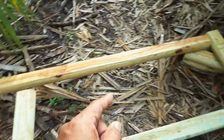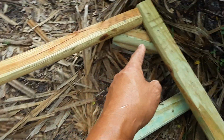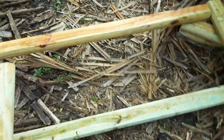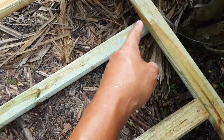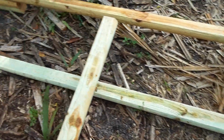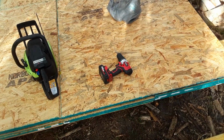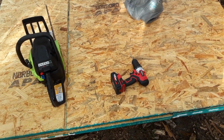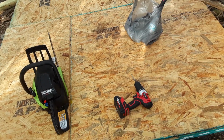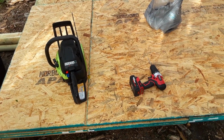I put most of the borders up, the edging, and it's being held up by cut up pieces of the landscaping timber here. Now my plan is to put beams here across approximately every 2 feet, because I had to cut these boards. These are some cheap wood, I think they call it sheathing, that I bought from Home Depot to use as flooring. I know it's not the best quality wood for flooring or even walls and stuff, but it was what I could afford.